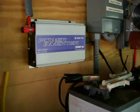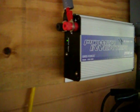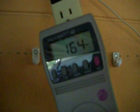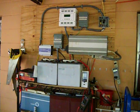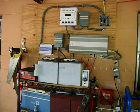You can see the light's moving — you might be able to hear the fan just kick on. It's thermally controlled. So let's see what we're at here: 163 watts, 165. So anyway, that gives you an idea of the efficiency. When you're trying to configure your system to operate, you want to figure about a 20% minimum loss between what you're getting in and what you're putting out.